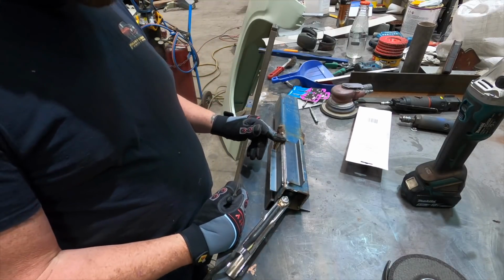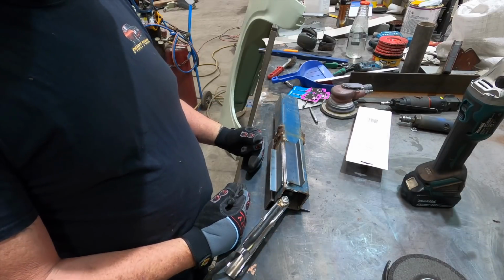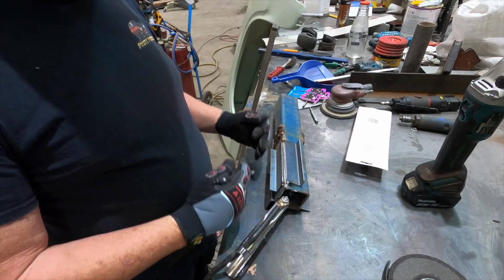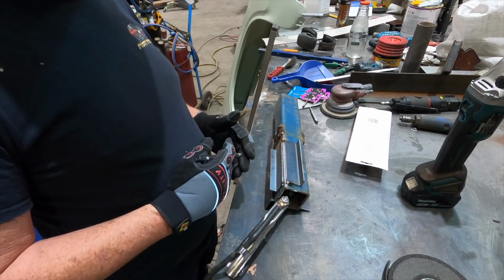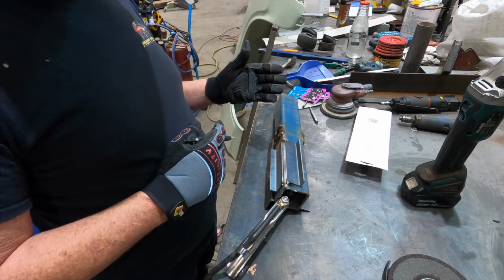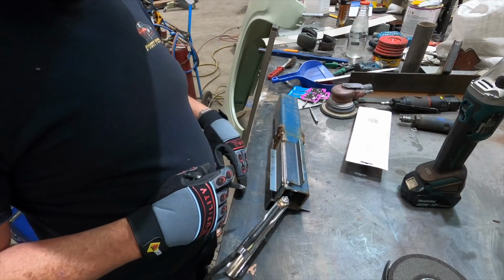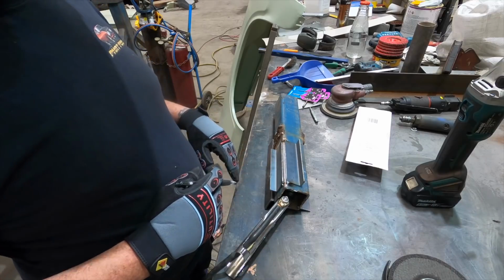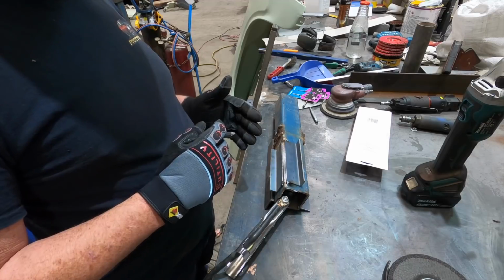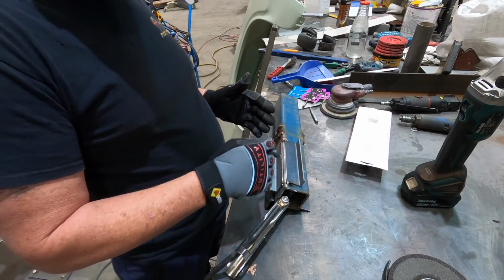And then, what else can I say? The other thing, yeah, you've got to get your settings. So if you're not sure about your welder, experiment with it and try to get it to a place where it actually feels and sounds right. You can actually hear a MIG welder when it's not really working. It's spluttering and throwing splatter and blobs of metal everywhere. But when you get the temperature and the wire speed just right, it almost hums, it almost buzzes when you're welding.